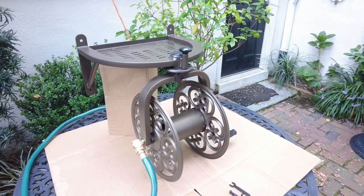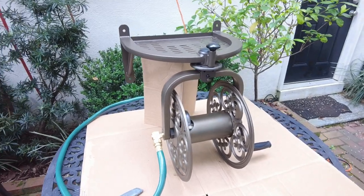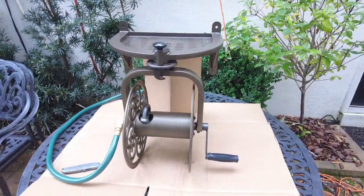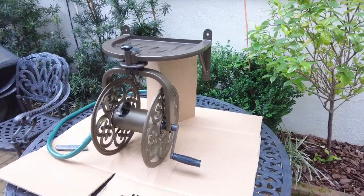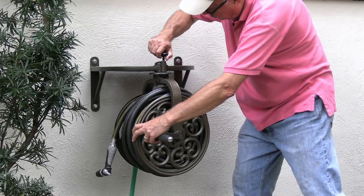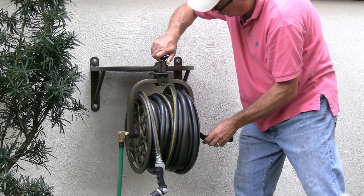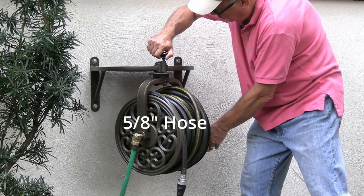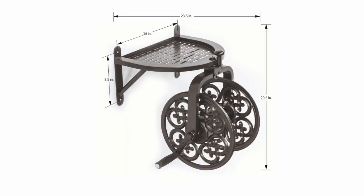The Liberty Navigator hose reel model 710 looks like this. It's designed to be wall mountable with what appears to be a very solid mounting flange. It swivels 360 degrees — for where I'll mount it I'll only need 180. It claims to hold 125 feet of 3/8 hose. The horizontal spacing of the mounting holes is 16 inches, a common spacing for wooden stud framing, which is a good design feature that makes mounting on two vertical studs easy in most situations.